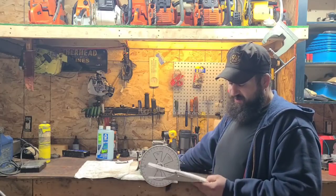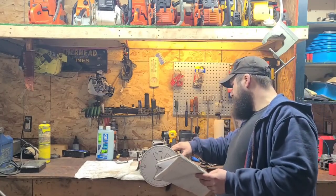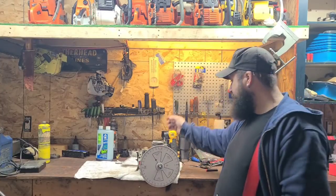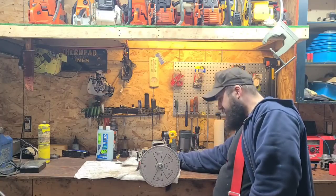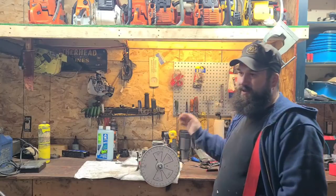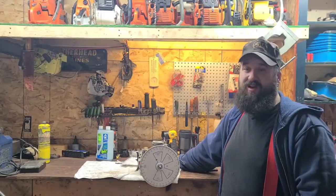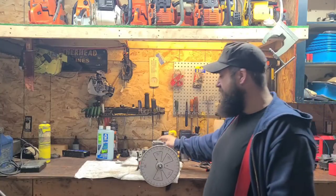Our intake was at 75 or 76 degrees. I just checked it — it's somewhere in between there. There's a lip in this intake port as it goes in, so it's not the easiest to time. It's telling me about 76 right now — that's before top dead center. That's pretty good intake timing. 75 degrees is 150 degrees of duration; 76 degrees is 152. I'm going to recommend you guys stay below 155 on your intake.